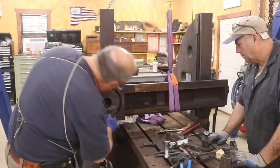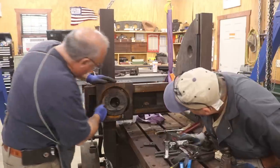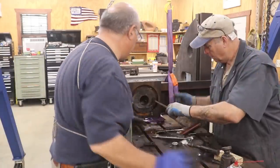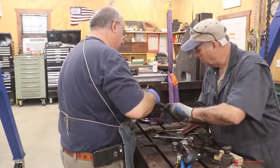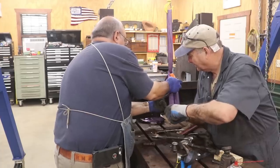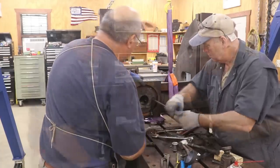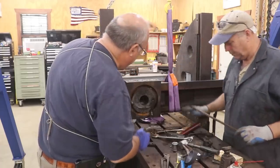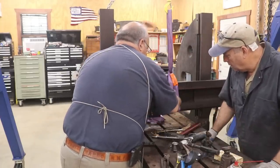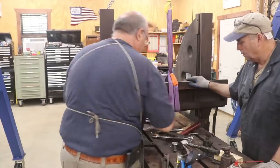There's a gear back here. Let's figure out what we need to do. Now there's where that bevel gear is that moves things up and down. There's a little casting on the back side of that we need to get out so that we can get this front piece off. So there's a screw here — we loosen that up and it releases that whole little piece in there in the back. We're going to reach back in and fish that out and get it out of our way so we can get that whole clapper box assembly off.